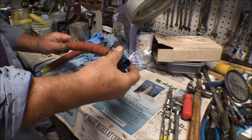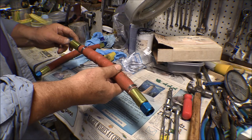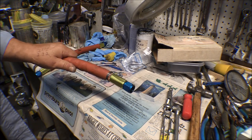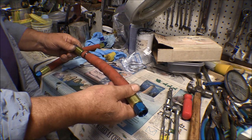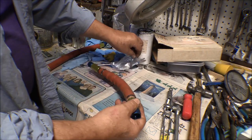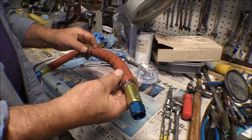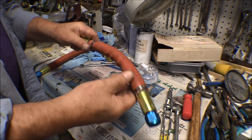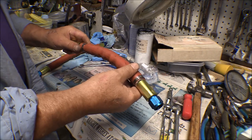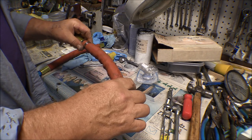I finished making up these hoses the other day — got the fire sleeve, cut it off, slipped it over the hoses, cut them to length, then made up the other end. I put them on the oil cooler to mount it up and get an idea of how it was going to mount. I've got these clamps to clamp them down on the ends, and these fire sleeves are not finished until you get them clamped down — you've got to clamp them so that any fire can't get in between the tubing and the fire sleeve. That's what the clamps are for: not just to hold the fire sleeve in place, but to clamp it down so flames can't get in there.